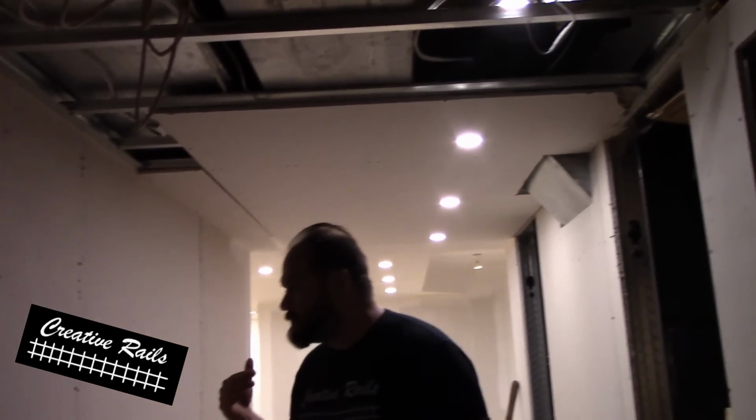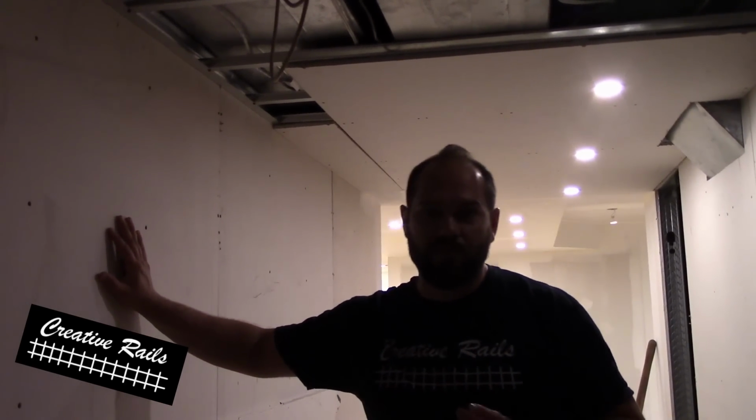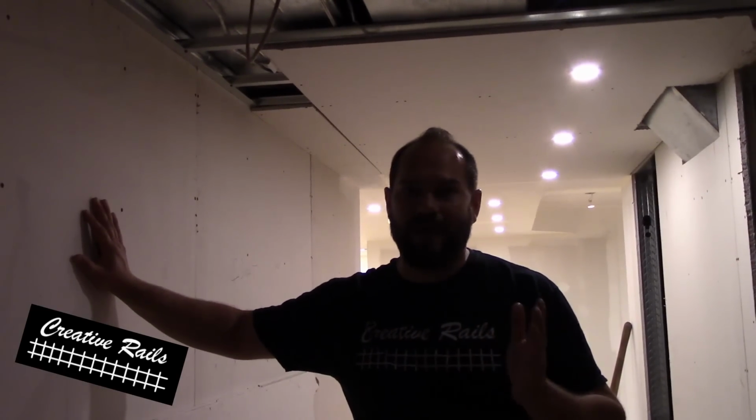Now, I'm a contractor. I've used steel studs for the outside walls. Some people don't think this is a good idea. It kind of goes back and forth, but what I've done, I've left the original insulation behind in the vapor barrier and framed in front of it. This way, you don't have to worry about having insulation in between the studs.